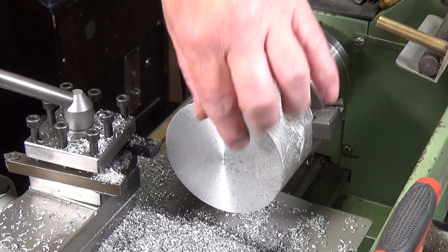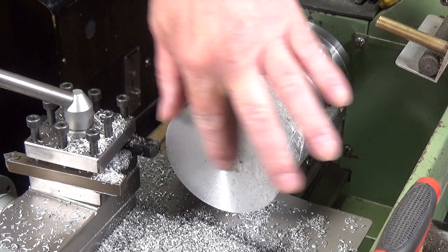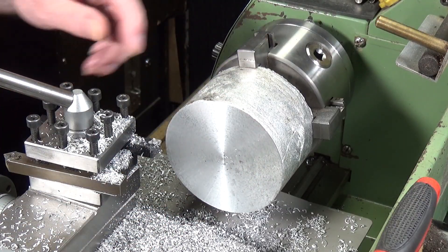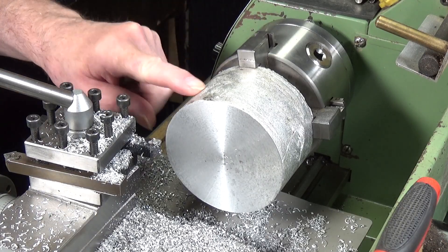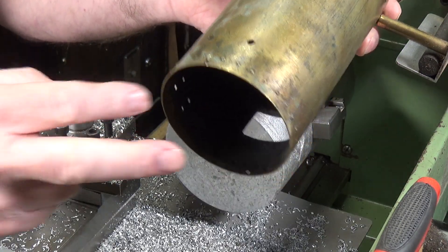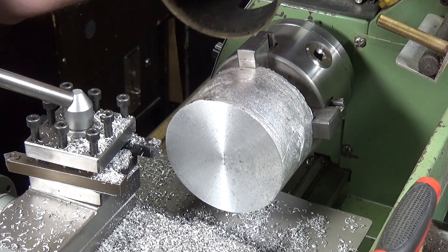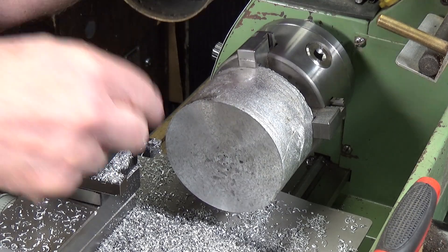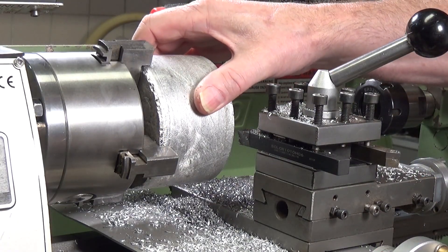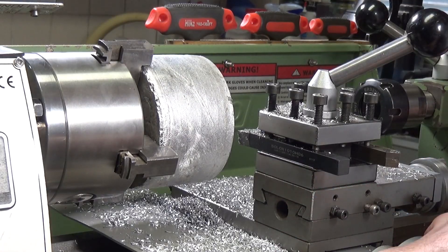The facing off is done and it's come out quite nicely. There are little tiny inclusions in the middle there, but for such a large pour, for there only to be these little tiny bits - I could probably turn those out, but it's only a riser so you're not going to see the underside anyway. That's machined very nicely indeed for home cast aluminium. The next thing is to turn this down so it's the same diameter as the boiler - it needs to be that diameter, and I'll turn it down to over an inch in length because I've got to cut it off and then machine a step so the boiler will fit over it. I need to take about 450 thou off, so I'm going to take a light skimming cut to start with to give us our zero - just a very small amount.